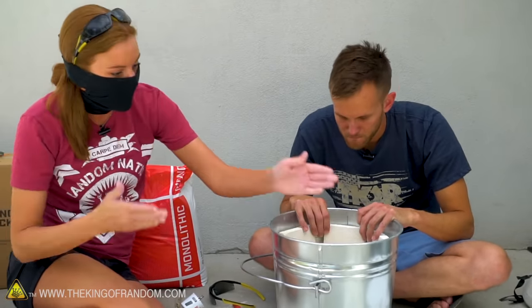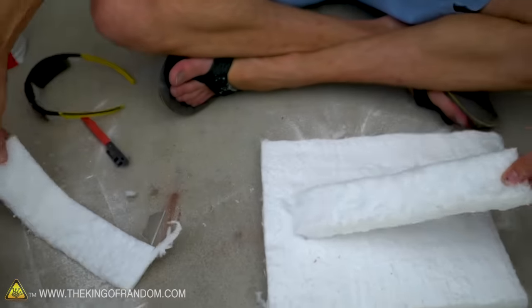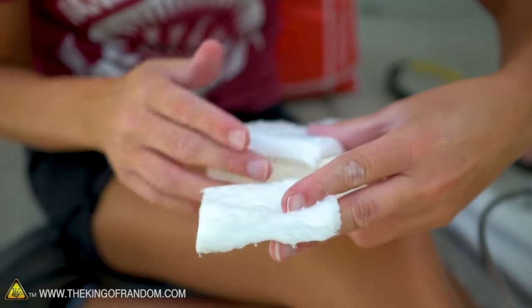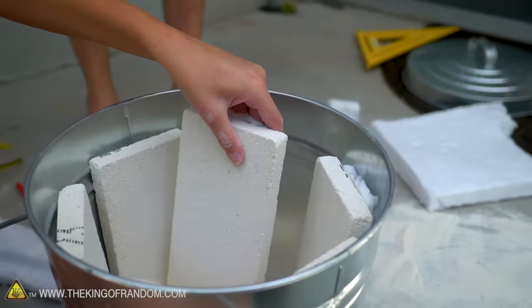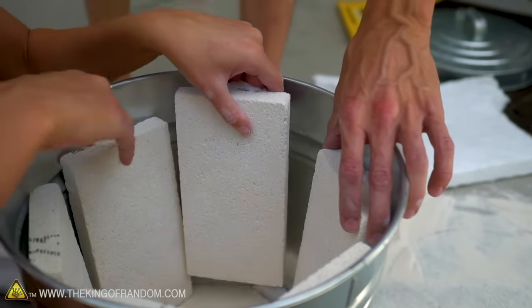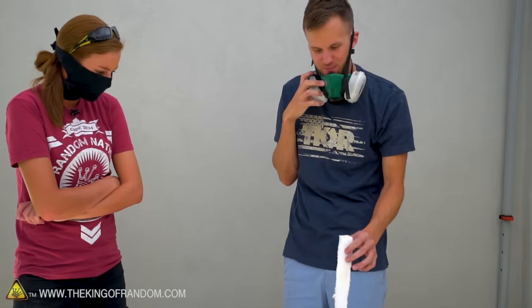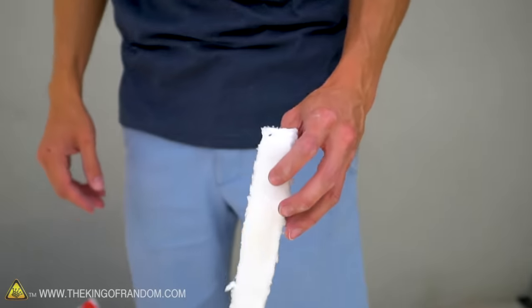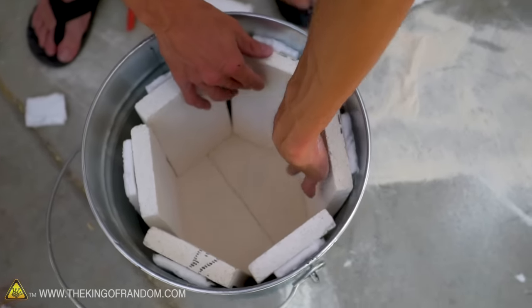I'm thinking if we can slice the kaowool in half like we did with the bricks, it actually peels apart. Yes — let's peel it in half and do some very thin pieces. We'll adhere some pieces of kaowool onto the back, place the bricks, and then put triangular pieces in between every single one so that it's double insulated with the kaowool, and then we've got the bricks closest to the flame. Kaowool is ceramic, not glass, so while you don't want to breathe it, touching it's not gonna do anything to you. I've cut a wedge with a slight taper going down and I think this will fit pretty nicely in between the bricks — just kind of slots right in, filling gaps pretty nicely.